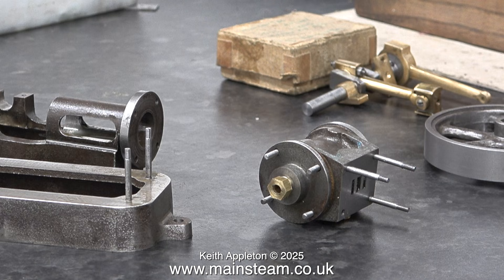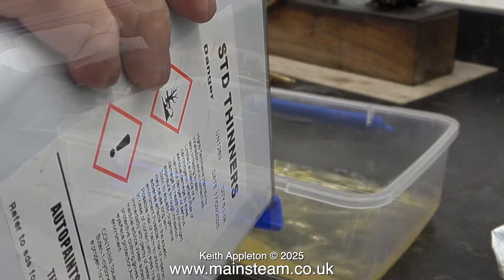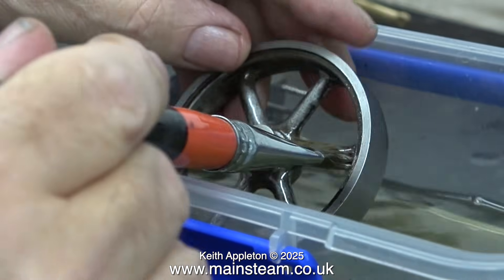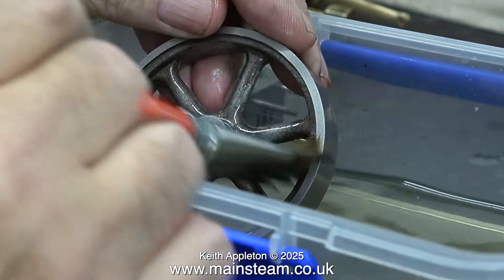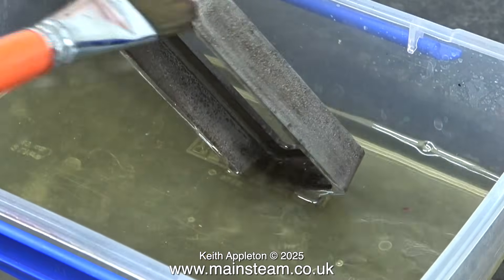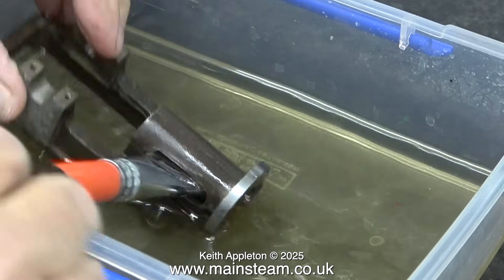Here are all the parts on the bench, including the cardboard box, and what I need to do now is part-fill this food container with some cellulose thinners. I've mentioned this many times before — cellulose thinners is also known as lacquer thinner in the USA. Health and safety warning: try not to get too much of this on your fingers, preferably wear a pair of gloves — which I never do — and also work in a very well-ventilated area. That's basically why I use a sealable food container, because when I've finished I will put the lid on, that way I won't be able to smell cellulose thinners throughout the house, as I'm in the workshop next to the kitchen. This cellulose thinners should be clear, but it isn't, because I've used it before, mainly from cleaning paintbrushes when it was still in the tin.